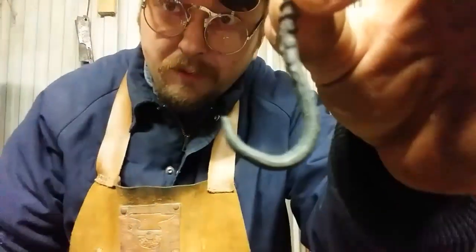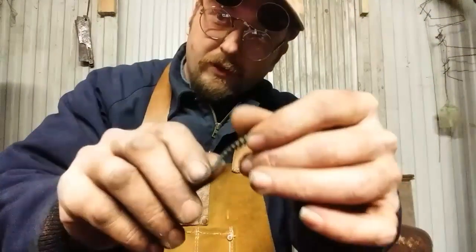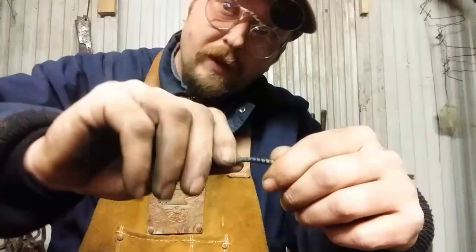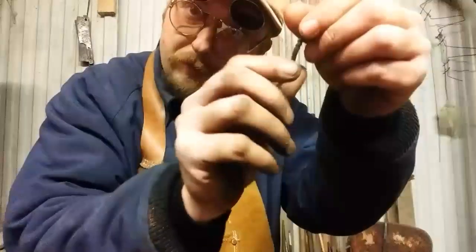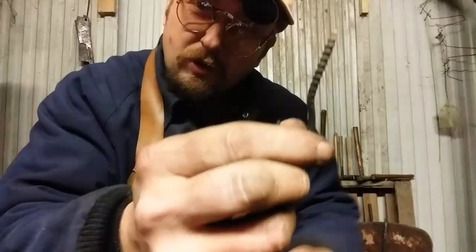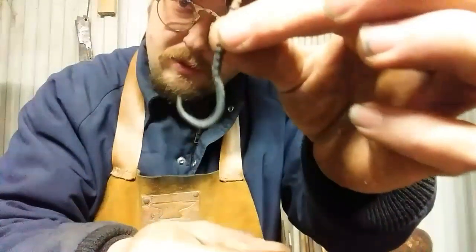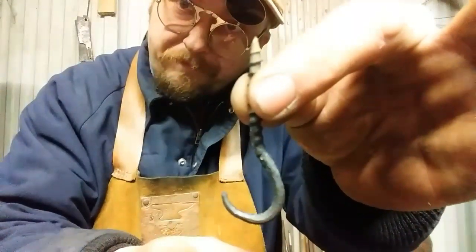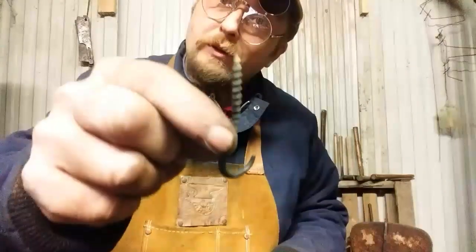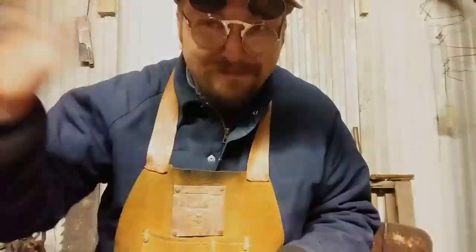Here's our little hook from a wood screw. If you're ever screwing these things into a small hole or directly into wood, you can lubricate it with a bar of hand soap and it'll help you. But if you drill a very small pilot hole, you should be able to screw this thing in no problem by hand and hang your little wind chimes and stuff. How pretty the hook is depends on how much time you want to put into it. I hope you gleaned something from this and that this might help you with a little hardware project. Until next time, bye.